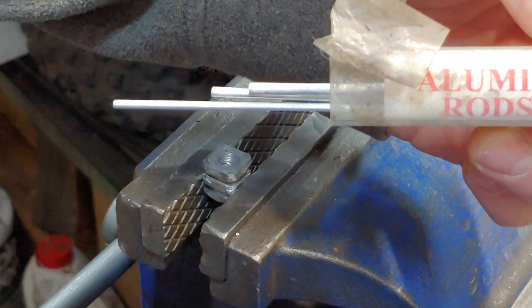It says there's no flux required. I have used this stuff before — I actually used it to fix a tunnel cooler on a snowmobile. We'll let that harden up and then we're going to flatten it out. I'm gonna put a punch in there for a punch mark, then take it over to the drill press and get a nice straight hole drilled in it.